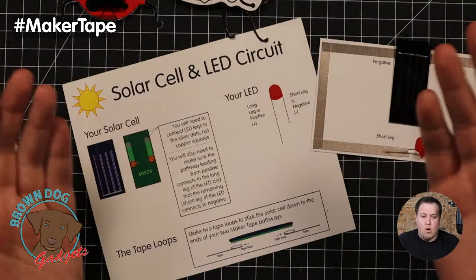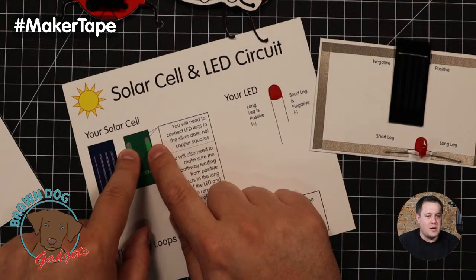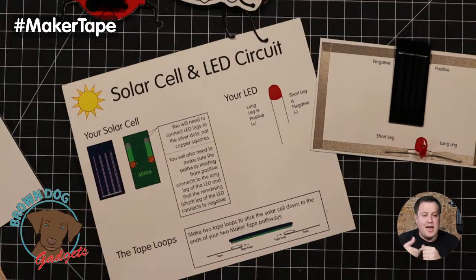That worked just fine. However, if you're not soldering, you've got to scrape that enamel off with like a penny or something. Usually there's some little silver dots off to the side that are sometimes covered with a black fabric tape or something else. Those are basically the through-hole solder point between the backside of the PCB and the front side with all the solar cells on it.